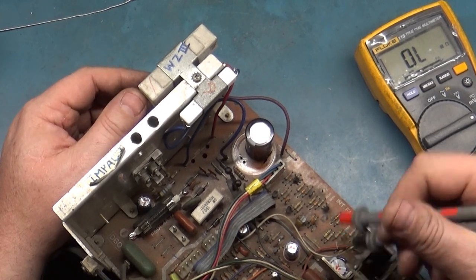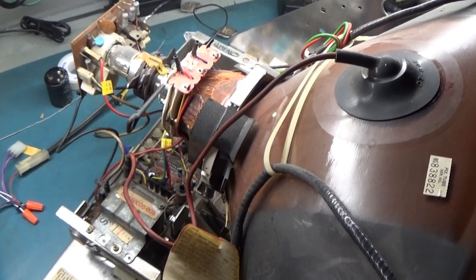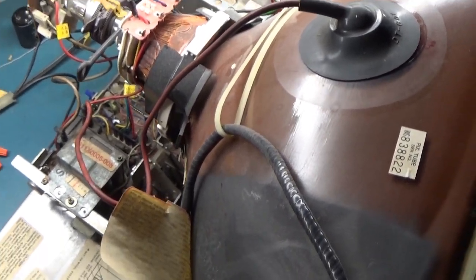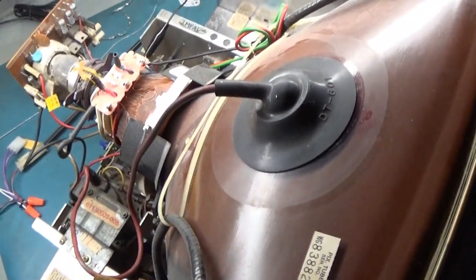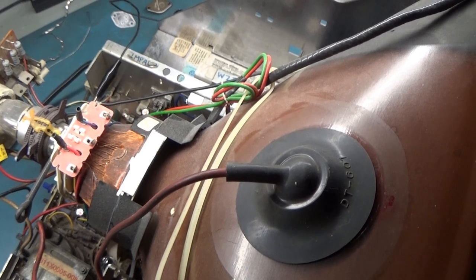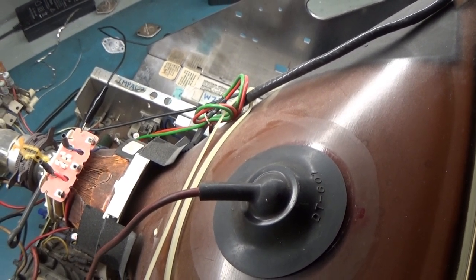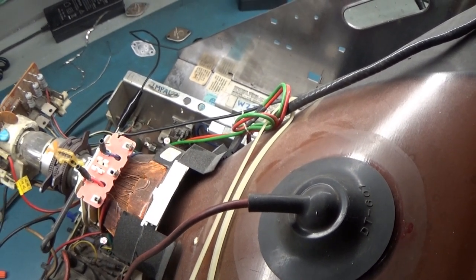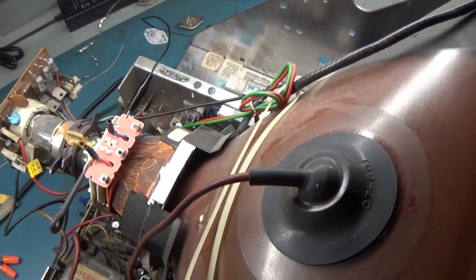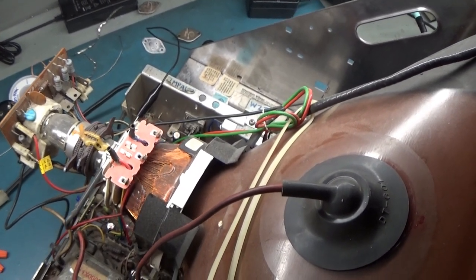All right, well, with those caps and the filter cap, let's turn it on, see what we get. Okay, take two. This time I'm just going to flip the switch real quick to try and save the regulator in case it's still no good. So let's give it a try. 1, 2, 3. Oh, nope. Just click, click, shorted immediately. God dang it. Well, I guess it's flyback time.